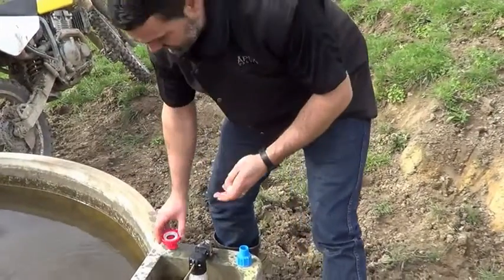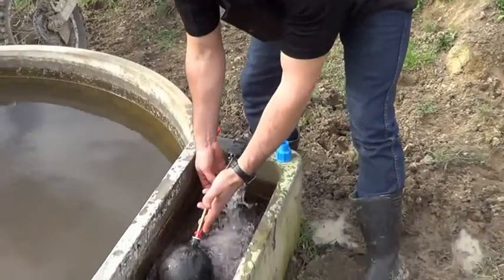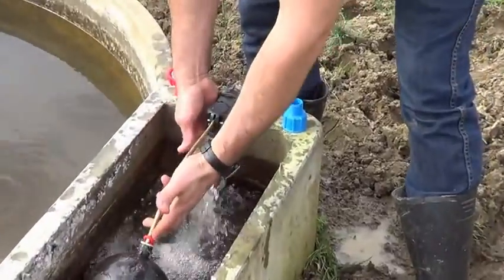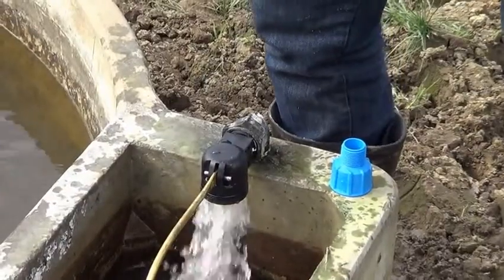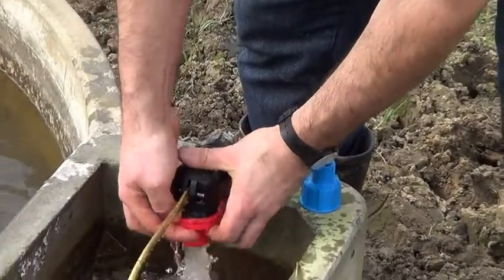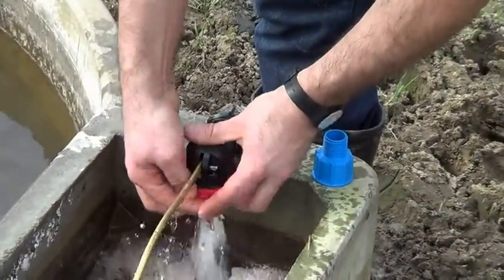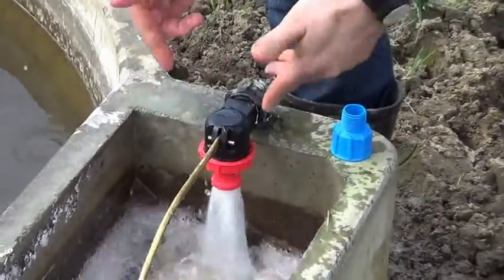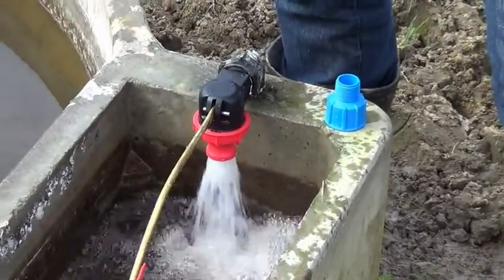Putting it back together is quite simple. If you line up the groove of the plunger in line with the arm and lift that arm up again, push it up inside the valve — it'll grab and sit there quite comfortably. If you screw the cap back on you may get a little bit wet, but it's easier than going back down to the pump shed. You can see the flow rate increase once the cap goes on and the enhancing ring pushes the water back through the valve. So now that valve has been fully serviced without having to worry about cleaning up your pump.